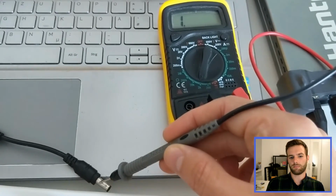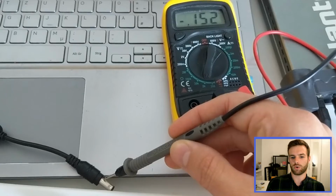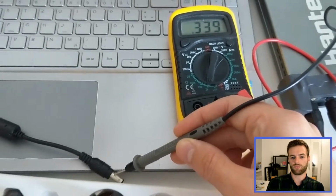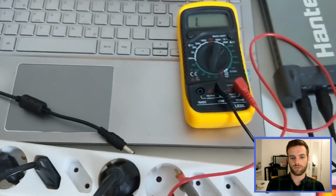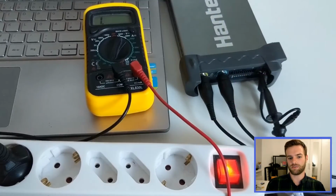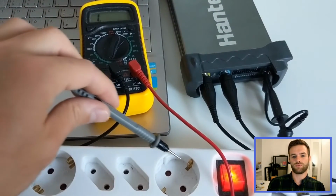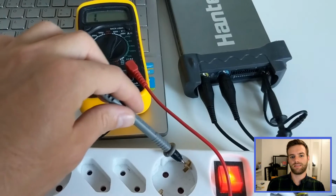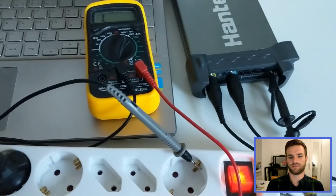The potential problems arise from the fact that the ground alligator clip is short-circuited to the computer's ground. Depending on our computer's charger, the computer ground could also be connected to mains earth, as it happens to be with my laptop. The easiest way to figure it out is to measure it. Here we can see that there are less than 500 ohms between my computer ground and the earth mains.